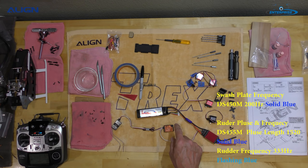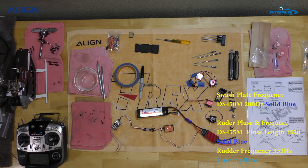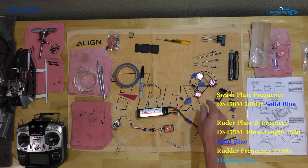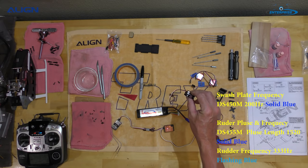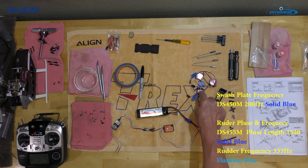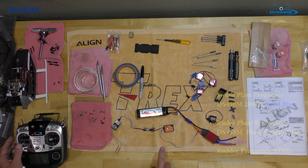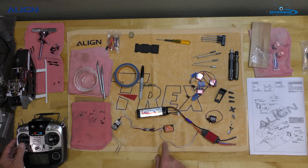But I go to swash plate servo update rate, which is option B. And it's purple, that's 50, that's the default. The DS450M servo can run anywhere between 50 and 200. It's gonna run a lot better at 200. So I'm gonna move my stick here and you'll see that the status light is gonna be blue. So I have set the cyclic